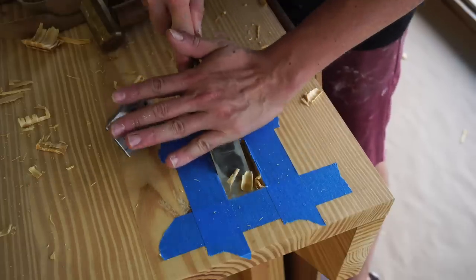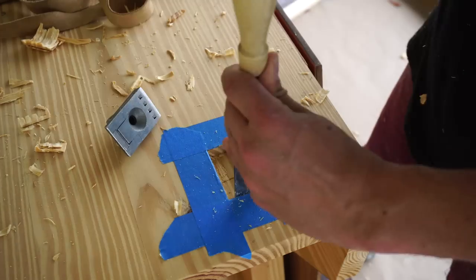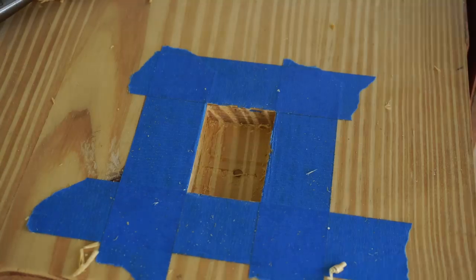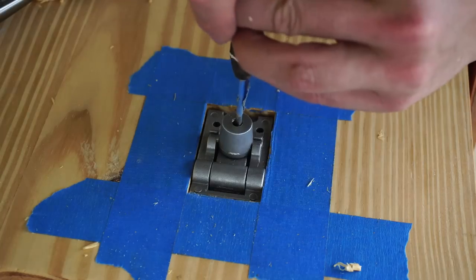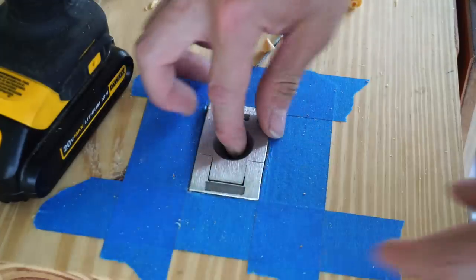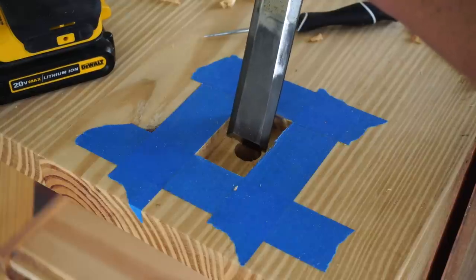For a plane stop, I picked up the Lee Valley aluminum adjustable plane stop and hogged out the mortise with a chisel. Schwartz mentions these in his book and talks about the unruly bottom shape, which makes these a bit difficult to install. This wasn't the worst, but I would suggest marking it out from the underside and drilling a hole larger than the screw post and working your way back from that. It took a bit of trial and error, but eventually it nestled in quite nicely.